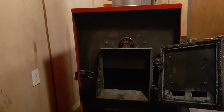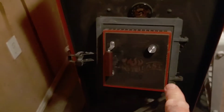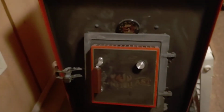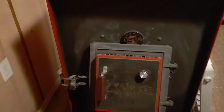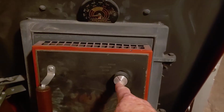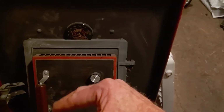I figured out how I want to do with my coal. And oh, on another note, when we was talking about the dampers again with a gentleman that asked about why I had that open. That thing is barometric. It closes off. Stove heats up, that closes off. This doesn't have any factor then, other than when it starts cooling off and it opens back up as it cools off.